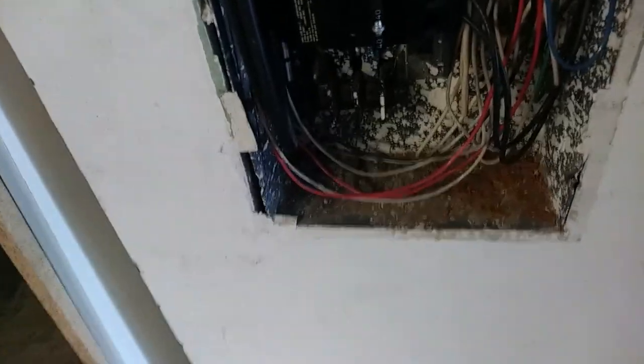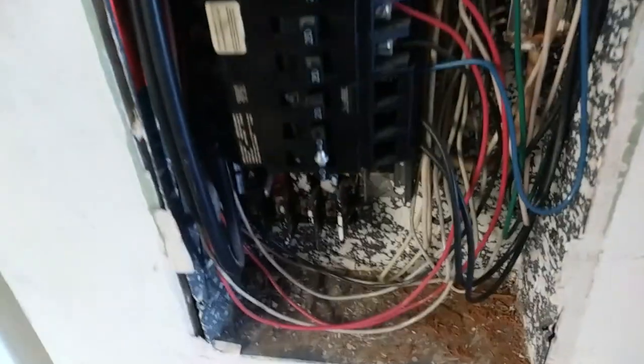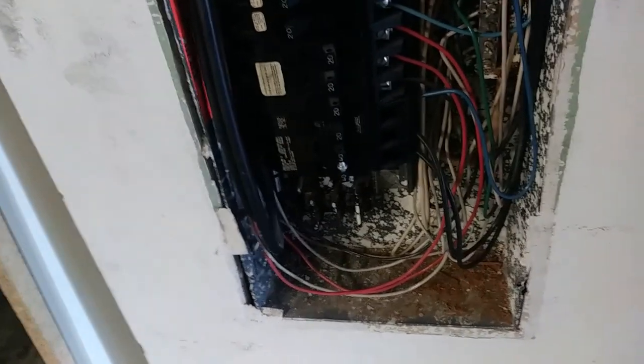A little lapse in concentration there. I'm going to need to actually get two breakers, two 20s, because 208, duh. I was thinking it was 120, I don't know why. So all I'm going to do to accomplish that is take the former neutral wire and go ahead and phase it, and I'll take that wire off and just put a wire nut on it.